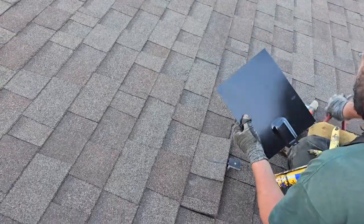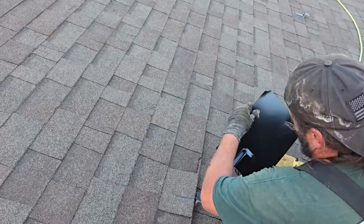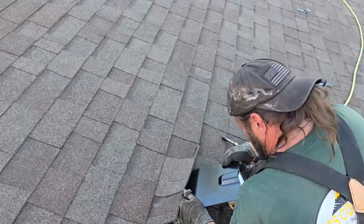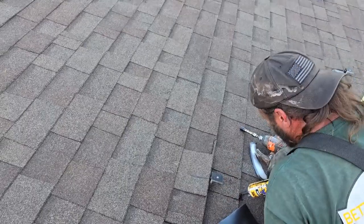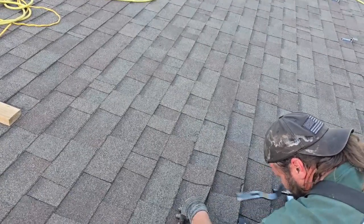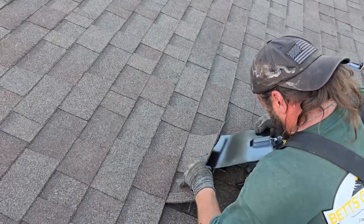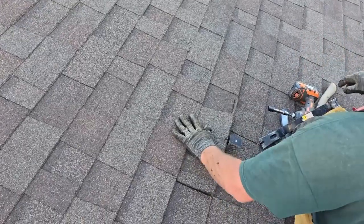When you're in the truss, you'll know it. You can cut these down to size so you don't have to remove two rows of nails. Remove the nail here — if you cut that down just two inches or an inch and a half, that's more than enough protection. Pull that remaining nail, get it sized in, and now he'll cut that top shingle so it lays out flat like the others.